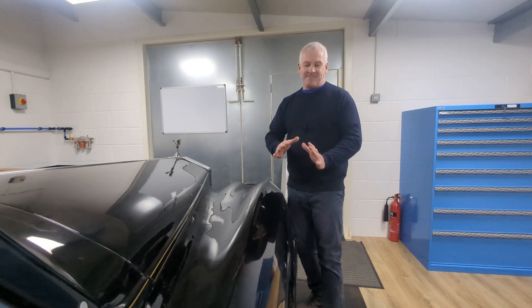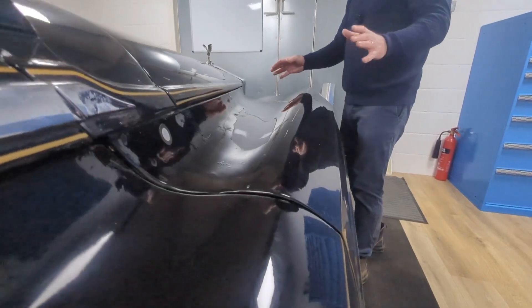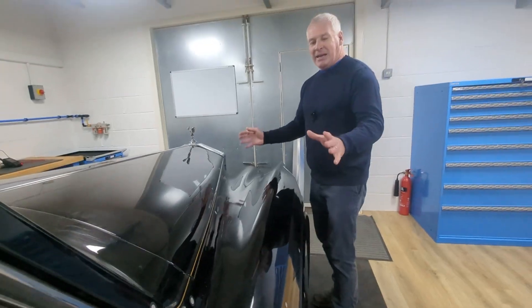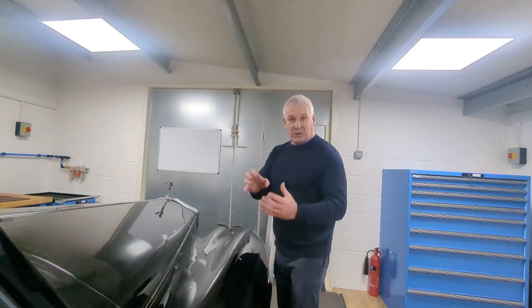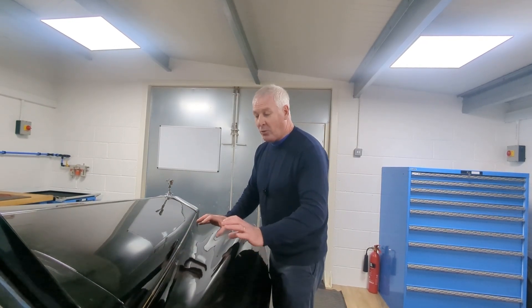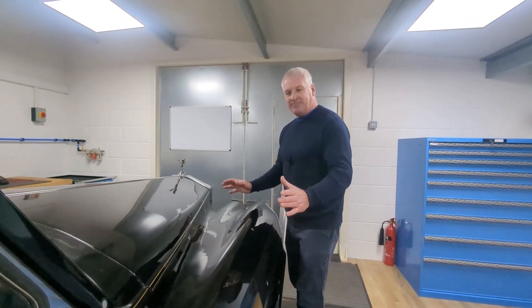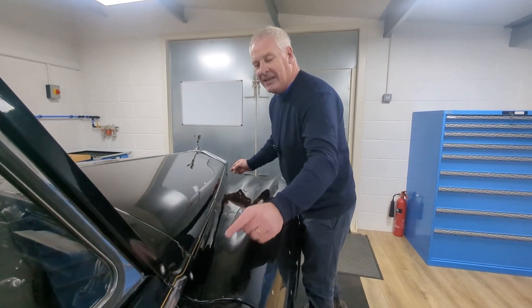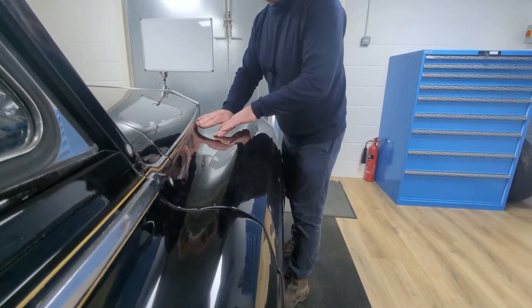The thing is, I've been after a set of rollers for ages, and I need them at least two meters long because this panel is 1.8 meters long. The problem is they're quite a thin diameter bar or roller, which you need — because with a thicker diameter, they won't roll. But the problem is they won't work over that length: they will roll tight at one end, tight at the other, but not in the middle.